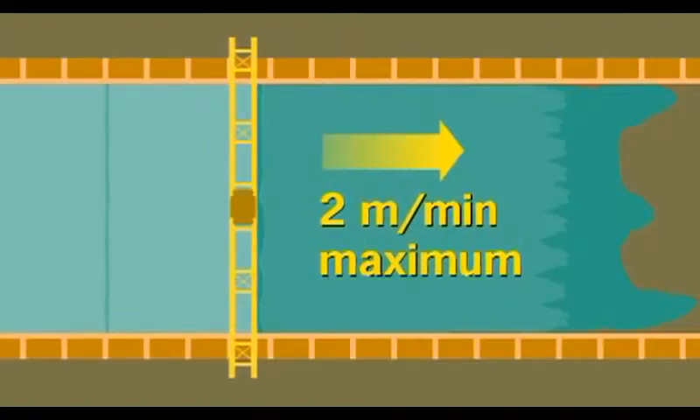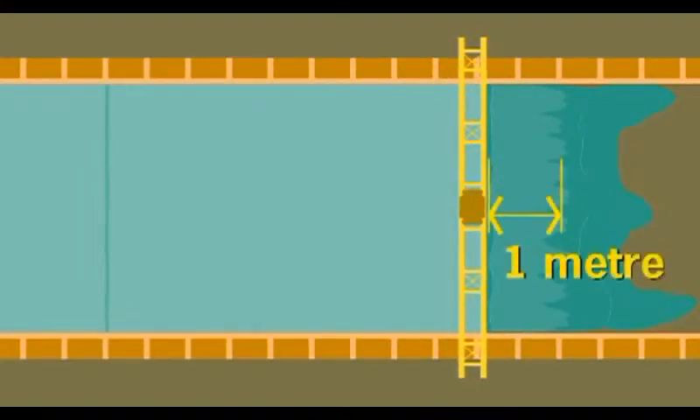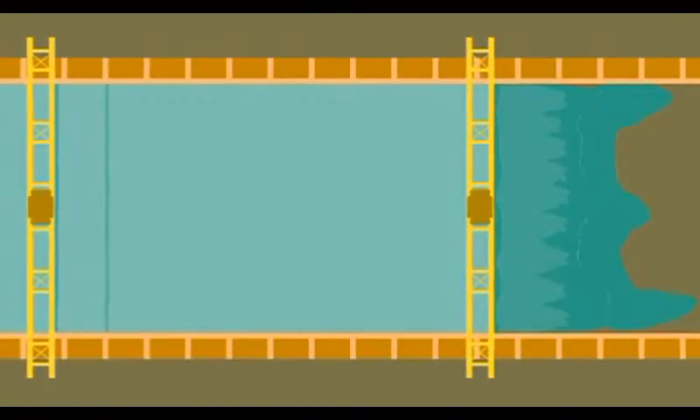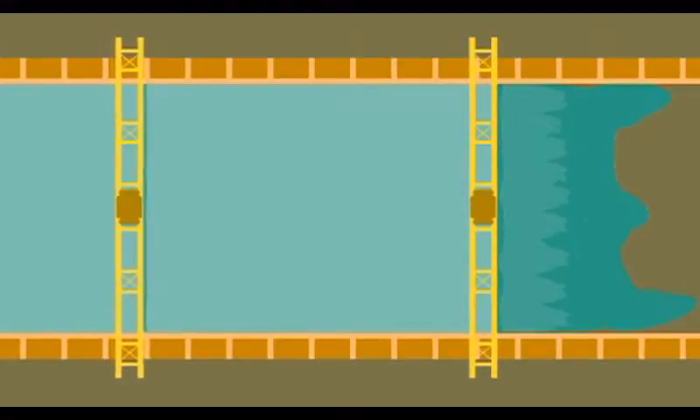Note where you ended each run, so you know where to start the next two metre run. Take the pokers out if you're held up for concrete. The next step is surface vibration, and you'll need two passes of the vibrating screed. The first pass gets the levelling nearly right — move forward no faster than two metres a minute. Use shovels to keep a fairly uniform roll of concrete, say 20 millimetres high, right across the front of the screed. Stop the screed about a metre short of where you stopped the pokers. This first pass can't help but be a stop-start operation. It's the second pass that gives the final surface compaction and finish — a slow, uninterrupted run. Because every time you stop a screed, a ridge will form in the fresh concrete and you'll need to float it, and that reduces the quality of the surface smoothness.